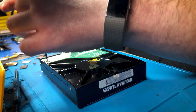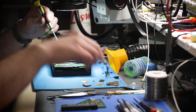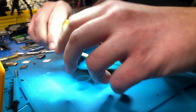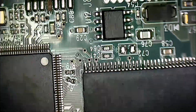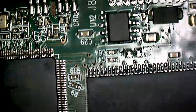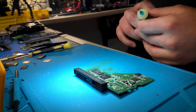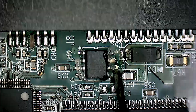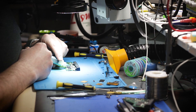I honestly hope the drive doesn't have bad sector issues too, because it's quite possible these drives end up with bad sectors. The board is off — put the drive aside for now. This is the original board. There's the ROM — let's get it removed. I'm going to use my expired flux because for jobs like this I don't really care to use anything else. Actually, before I do that, let me get the donor board and remove its ROM so we can prep the donor board to accept the swap.